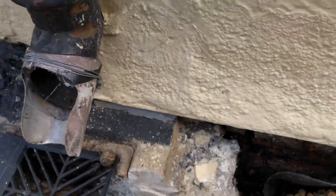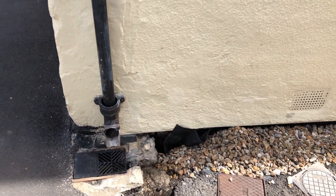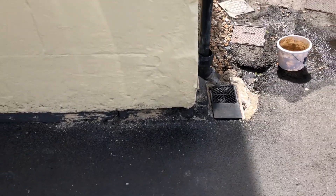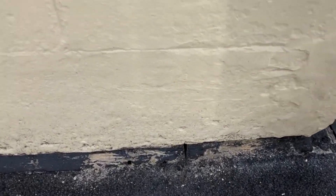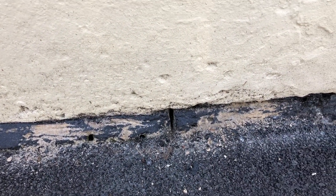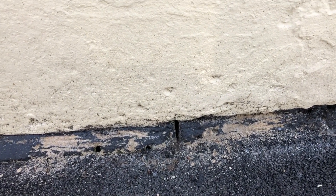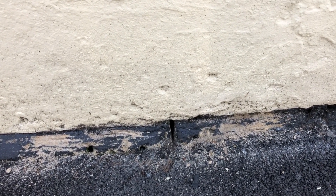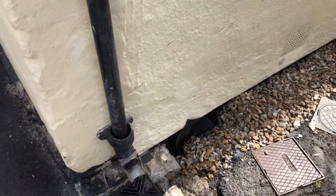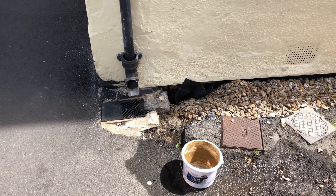All this needs to be fixed before you even think about doing any sort of damp proofing inside. If you're looking to get some damp problems fixed, you've got to keep things very simple. It's an investigation. Everybody says they're working to BS 6576 — well, the first thing it says in there is basically eliminate everything. We can see the actual causes of the moisture here. If you're going to do anything inside, it's a complete waste of time unless you fix all this stuff.